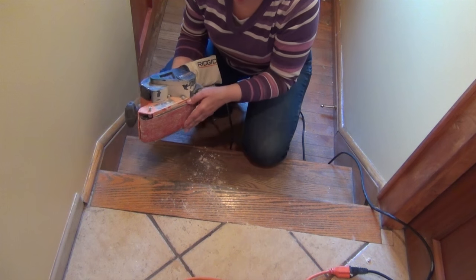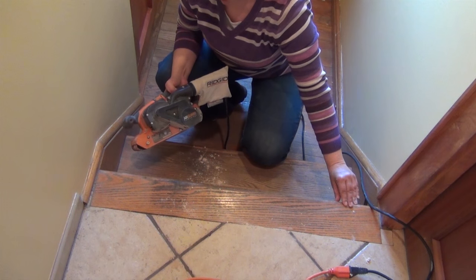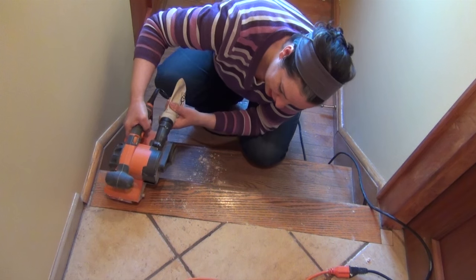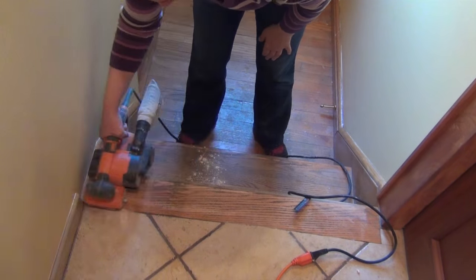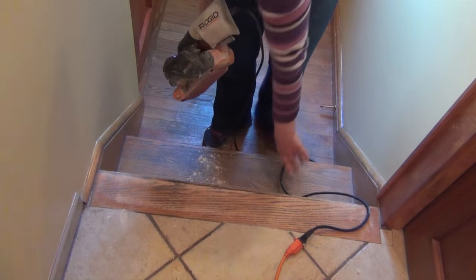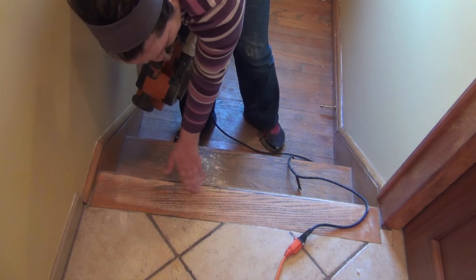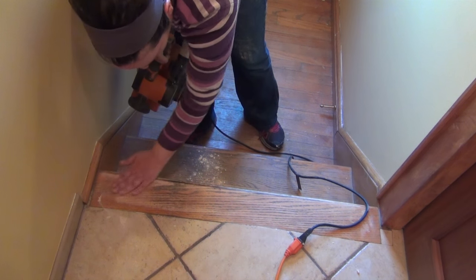I have my sander, I changed to the rough band. I'm going very gently on the edges because I don't want to bevel them. I'm going to do a little bit here and definitely a lot on the steps and the flat area. I've removed most of the first layer — going to go over one more time and move on. It looks pretty good. I really want to be careful and not bevel anything; I think once I hand sand it with the steel wool, it's probably going to look better.